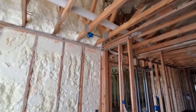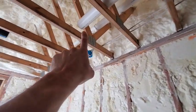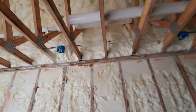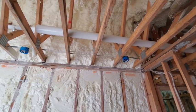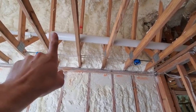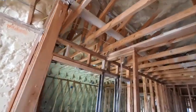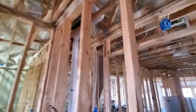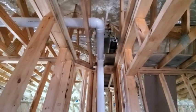I've got the ERV vent run to the bathroom and the master bath - got that all run now. I'll come off the end of this 4-inch pipe with flex duct and connect to that 4-inch pipe. One thing I thought of is if I'm pumping moisture through there, it's probably going to get condensation building up on the walls, so I'm going to lift this end up a little to make sure condensation drains down the pipe. I don't want it leaking in here anywhere. I did glue all my joints, but the water in there should evaporate.